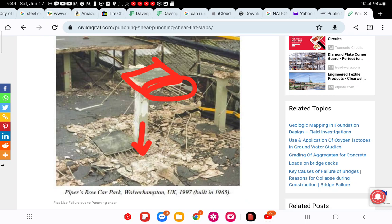This area here went down also, so the deflection mirrored itself — it reflected and broke all the way over here, which tells us they probably did not have the critical shear zones built up properly. But remember we still have that offset column I'll show you. Let's go to that now and talk about it.